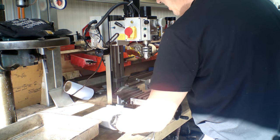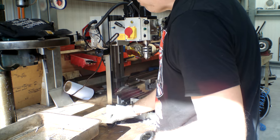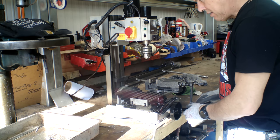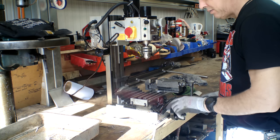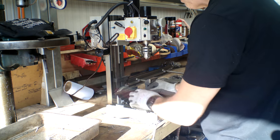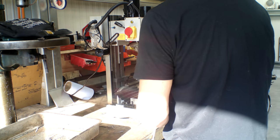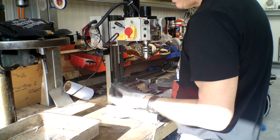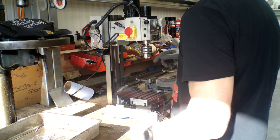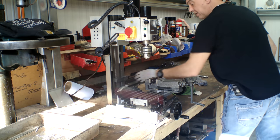Next - the milling machine. It is a rubbish one, but it does what I need. Ideally it'd have a DRO so I could get a bit more precise, because the trouble is the graduations and the slop - that's the amount of backlash it's got from the screw going one way to the other. It's like half a turn which is ridiculous, so I tend not to trust it. It's very much a case of machine what you're doing, then measure it, then machine a bit more. It makes a god-awful mess - all this lot is from drilling. First things first, everything gets blown off.